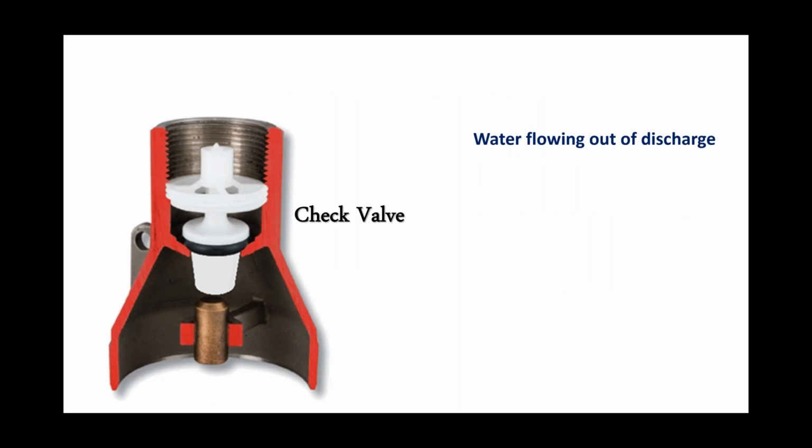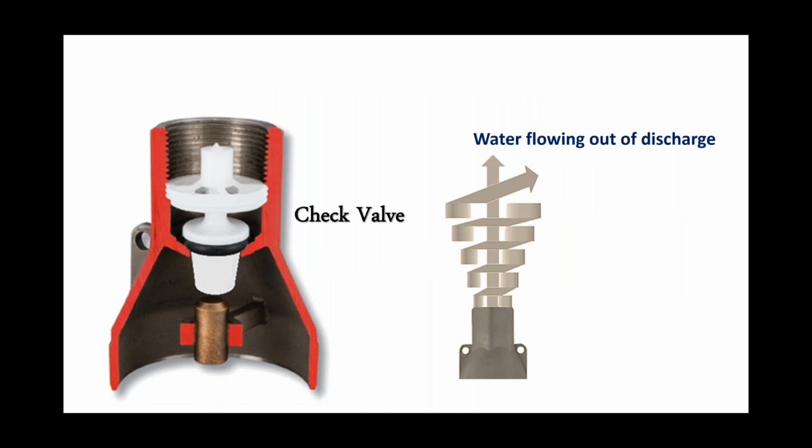The reason I have that opinion is, if you were ever to see the water as it's exiting the discharge of the pump, not coming out the drop pipe, but out the discharge of that pump, that water is spinning at about the rate the motor turns, which is 3,450 RPM. So it's very, very turbulent. I'm going to try to get my highlighter up here. But in this area through here, that's a very, very turbulent environment.